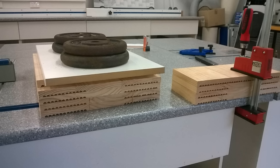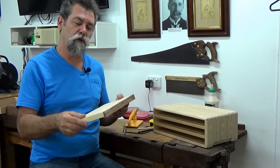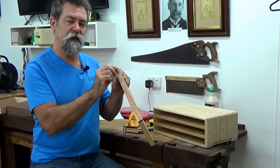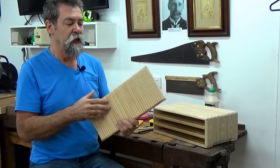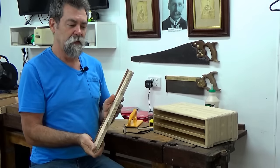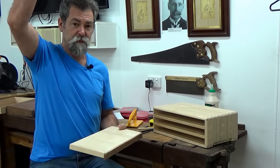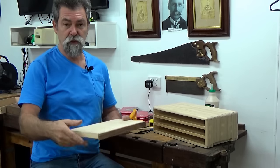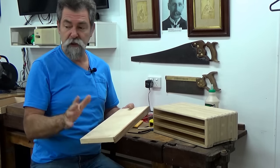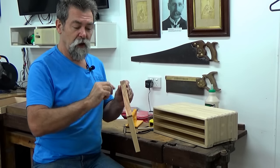While waiting for the next stage, I stack these upside down and put weights on. Before gluing on the stiffener — which is also the border for the gutter at the back that takes the razors and sharpeners — I want this piece to be straight. I leave it up with a heater above, or on a nice dry day just leave it on the bench and it will start to straighten out. In my shop I've got an air conditioner — I can turn that on, it dries the air out, and the board will come straight.